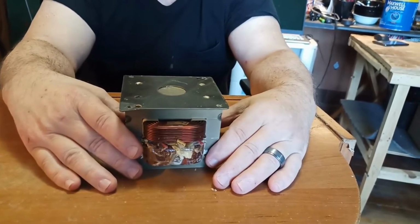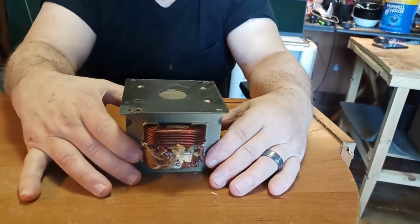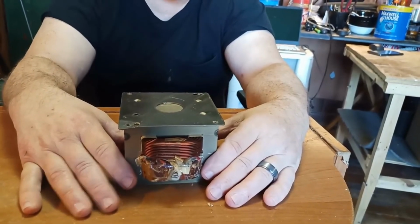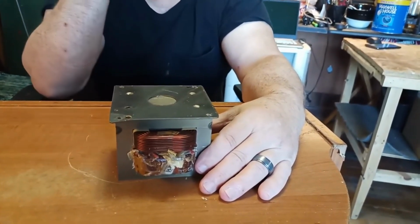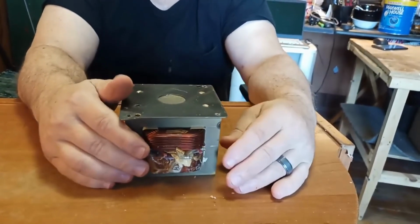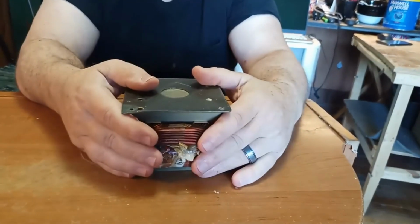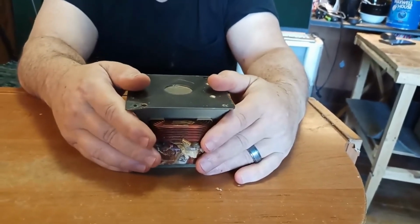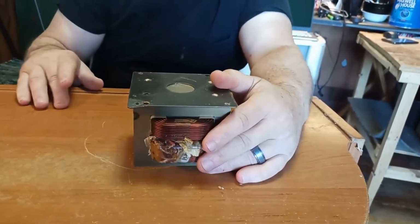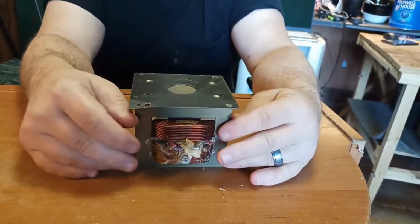But to put as much service in as it did, that A.O. Smith, I'm gonna tell you, that's a good water heater. So, that's what we got to replace it. We got to do some adjustments on it, but once we do, we'll be real good with that. We got the hot water. That's not a problem. Just don't have the pressure. The pressure regulator we put in set at 50. Well, apparently that's not good enough, because it don't put out like it did before with the old one. But we need to replace that too, because that old one is done put in its time too. It was due for a change.